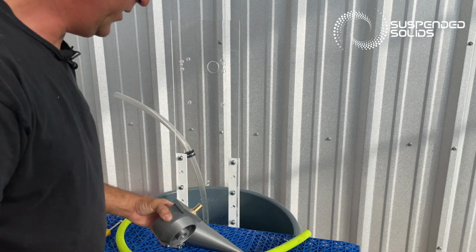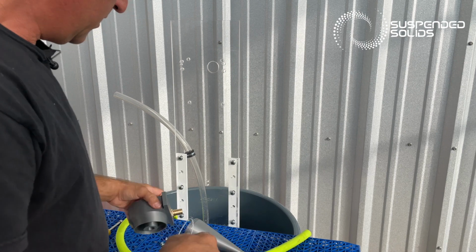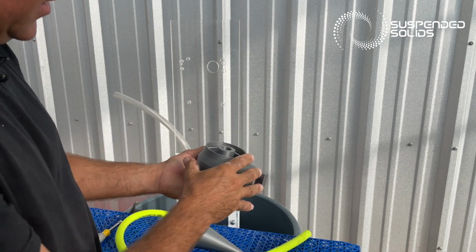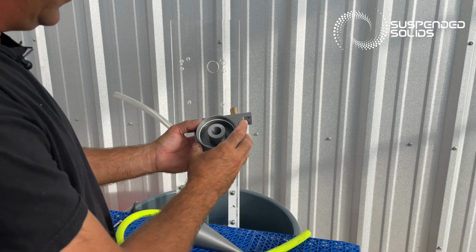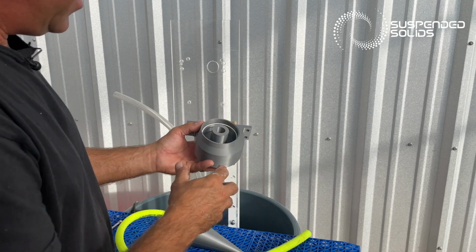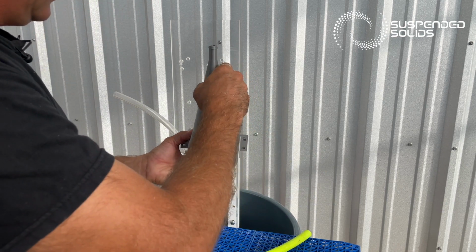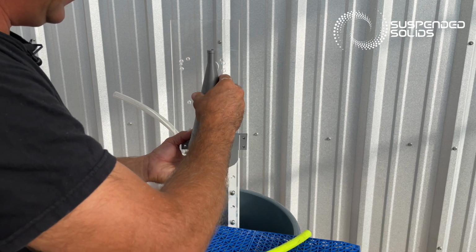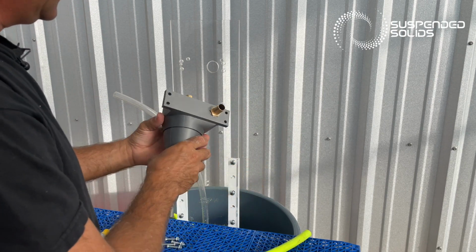Instead, included with the hydrocyclone is a small thermoplastic ring that goes inside and sits inside a small beveled area inside the hydrocyclone. It's only about, I don't know, 1/16 of an inch thick or 1 millimeter, and making sure this sits in there correctly is very important to getting a good seal. Once you put the top on and screw it down, you'll feel it make contact. Gently give it one additional firm turn and you should be good.